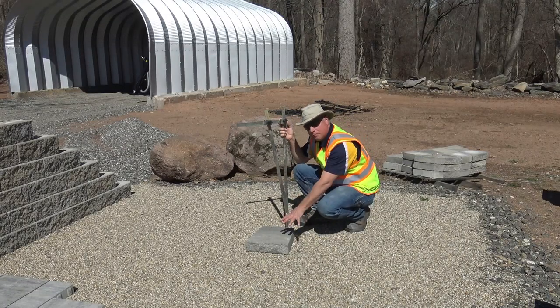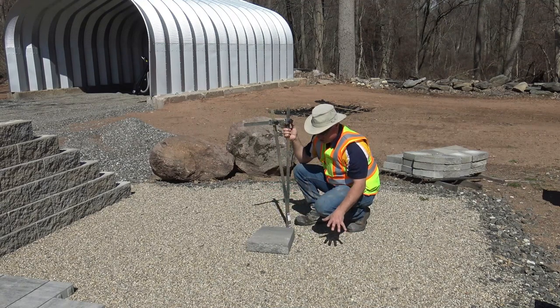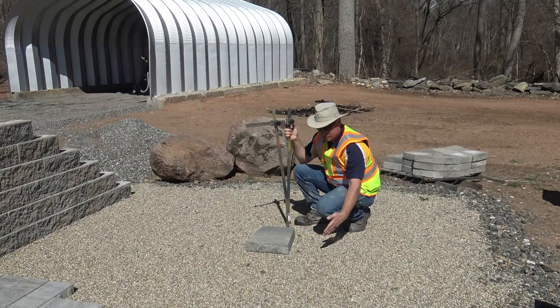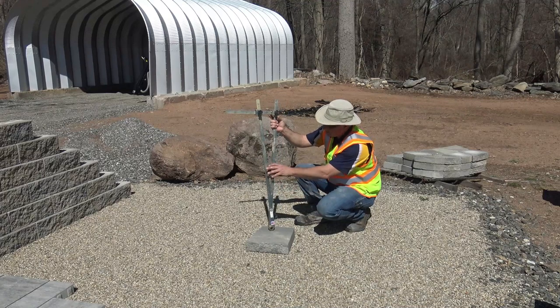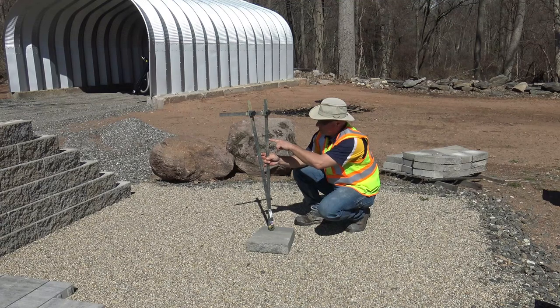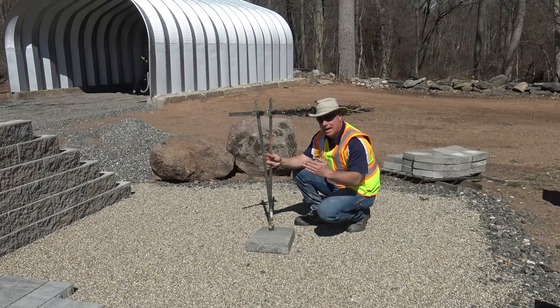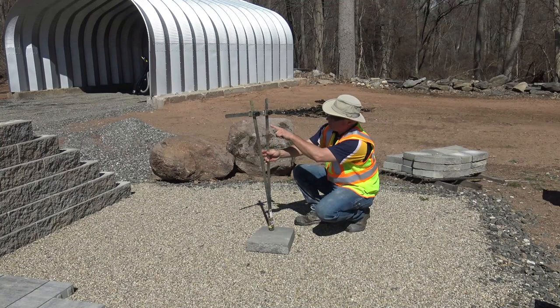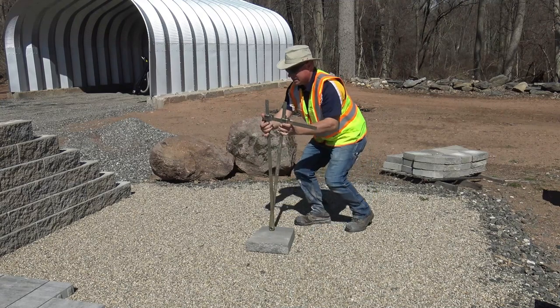When installing a fire pit, if I'm using a cap such as this, this generally would make a 6 or 7-foot radius if I laid them all together. A fire pit's not that way — we have to do a nice tight radius. We created the radius template marker and this has the sizes built into it. You can see 24, and every one of these notches is an inch. So if I have a 30-inch fire ring and I want to hang my cap over 2 inches, I'm going to go up to 31, 32, and adjust my tool at 32 inches.